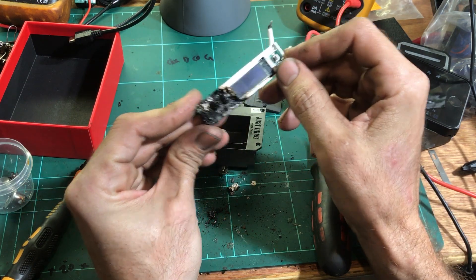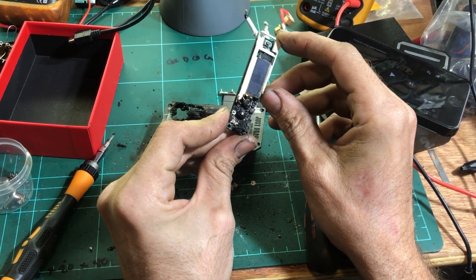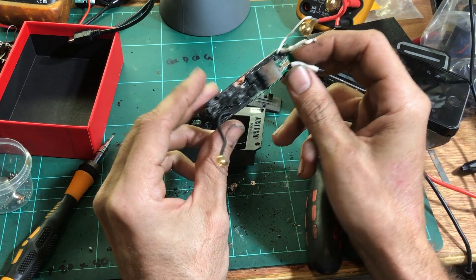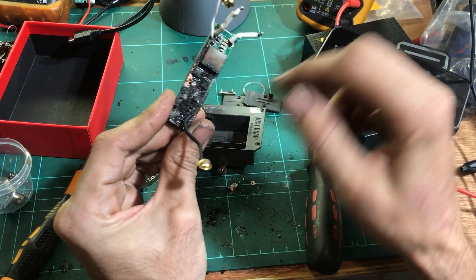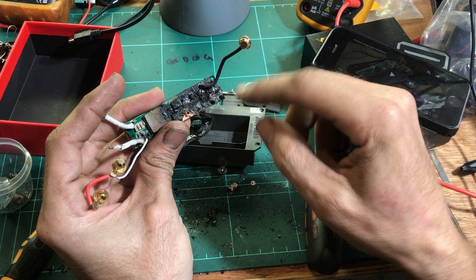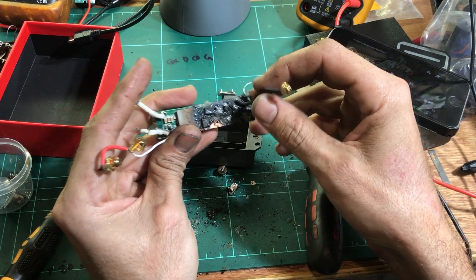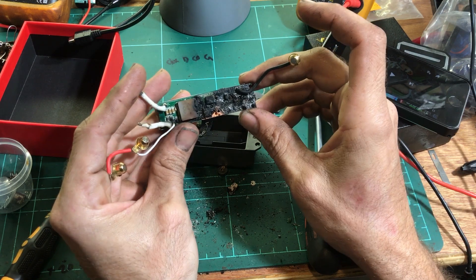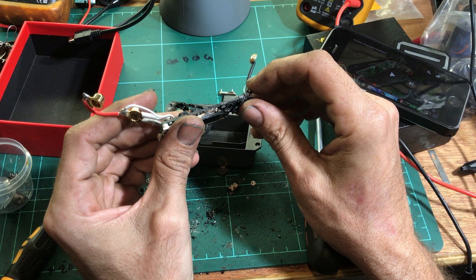So at this point I can't really make any other decisions apart from: either juice damage, or something's failed massively on the board. It could be unrelated to juice completely — could just be a board fault. It could be this MOSFET. MOSFETs do fail — sometimes they'll fail open, sometimes they'll fail closed. Just if it fails closed or switches closed on its own, it could completely mess things up. Obviously I can't test any other components in here to see if something else set it off.